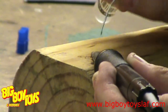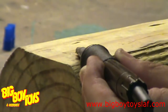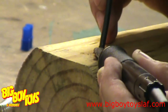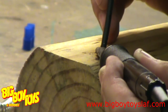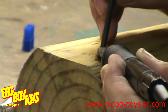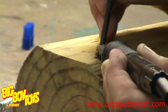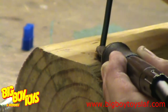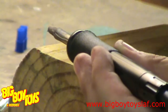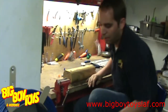I've got it about halfway filled with solder. Next I want to take my wire that I've already pre-tinned and submerge it in there, and hold it until you can see the solder between the wire and the connector completely flow together. You'll see it actually flow together and become one. Once it does, you can take it out and your connector is on it.